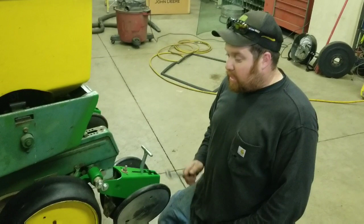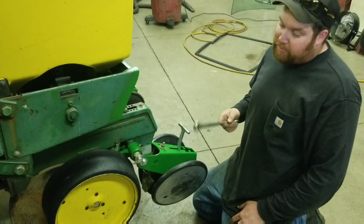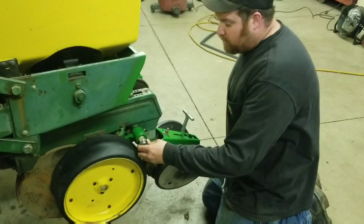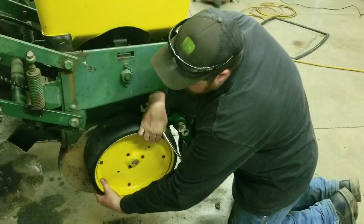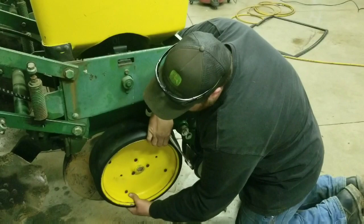It's very crucial to make sure that these scrapers are in good shape to keep this disc opener clean. Because if stuff starts sticking to that disc opener and it starts wedging in between here, the next thing you know you've got all this turning too hard and the row unit just decides to push. So when you adjust these, make sure you hold them up to where you think they ride out in the field according to your depth, and then let them adjust against the blade. Because if they adjust down here, they're going to pinch it way sooner, and that's not going to be right. You've got to hold them up the right height that they usually ride in the field, and then adjust them.